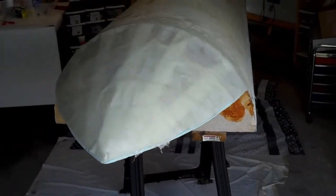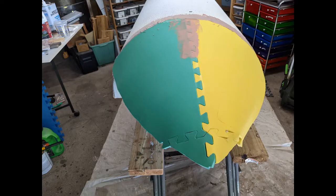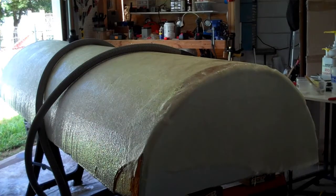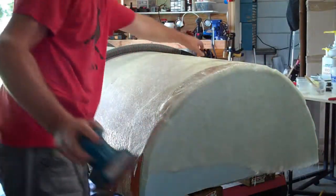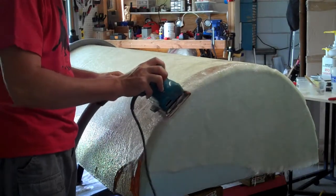As I mentioned in my last video, using plastic wrap on the nose cone didn't produce a very smooth result. I had to fix that with a lot of work and Bondo later on. In my second pontoon, I used EVA foam to make the nose cone nice and smooth. Between each layer of fiberglass, I sanded the surface to smooth it down and ensure the next layer can adhere well, because epoxy resin is very smooth when it dries — you want to sand it to give the next layer of epoxy something to grip.